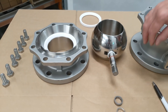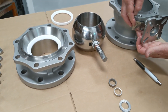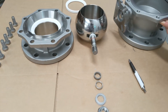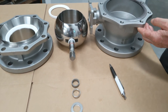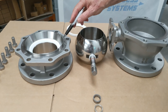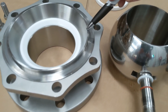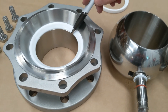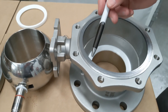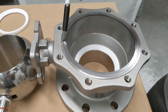The API 607 certification tag is around the neck, and the API certification is also lasered on the side of the body between the two flange faces. There is a raised section where one half of the split body slides into the other. The ball then rotates on the PTFE seat, and on this other unit you can see the graphite seal still in place, which gives a seal between the two body halves.